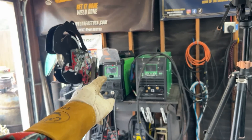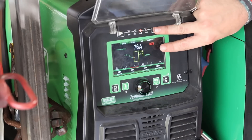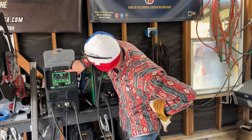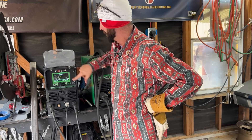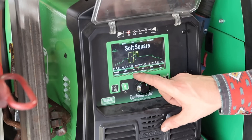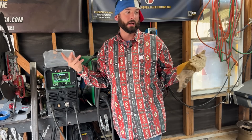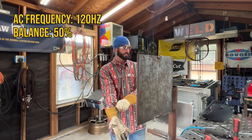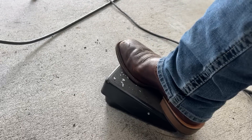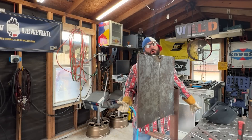I think we can do a couple more things with this Typhoon. Now we're about to get a bit crazy — we're going to go over to the AC stick. Yeah, I said AC stick. We can do it with these settings or even go into DC or AC TIG and run it with the foot pedal and high frequency start with those same settings. Since TIG and stick are both constant current, why can't it work? We've got the machine set to AC, frequency and balance set, running a foot pedal with high frequency start — and this is all really just for fun.